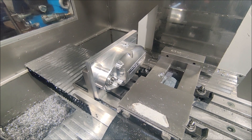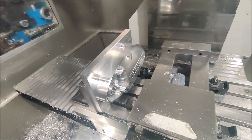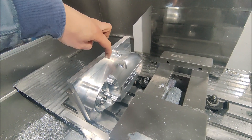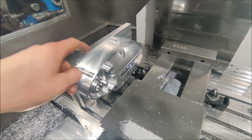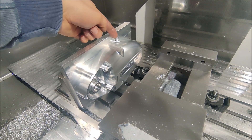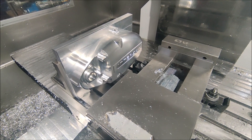The part is now back in the CNC mill. I mount the fixture plate on this angle plate and bolt it down. Set the work coordinate system on the fixture plate - the center of here, the side of this, and the top of here - so then Fusion knows where the part is. I need to machine this hole and mill the slot in here and drill a small hole. Not a lot of work, so let's get it done.